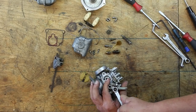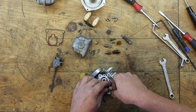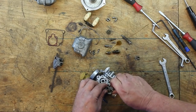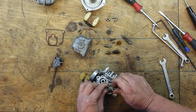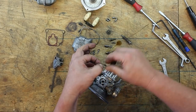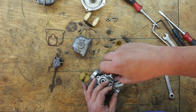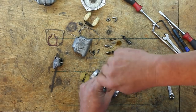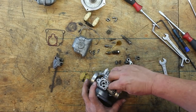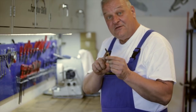I'm going to loosen this nut here. There's a wave washer. These two plates come off — just leave everything in that orientation. Now we can remove these two screws. This pipe comes off just like that, now the shaft can be removed, and that's the O-ring that we're going to replace.